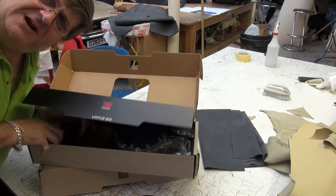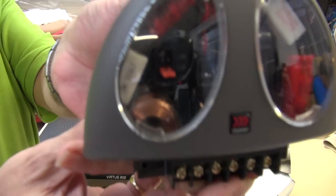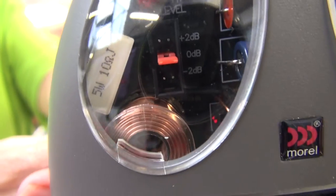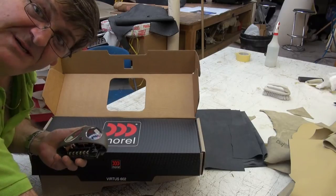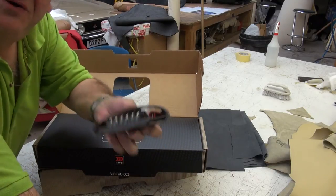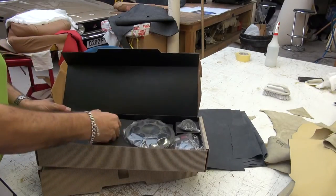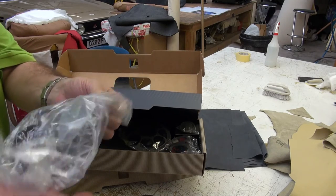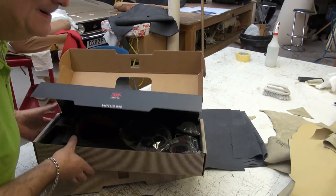Passive crossovers — the bits that are the traffic cop for the sound that sends the tweety bits to the tweeters and the rest to the others. Well, these are typically beautiful Morels. If you look deep into the actual box: zero dB, plus two dB, minus two dB. That's a little jumper that you move that engages or not those little square resistors, which is basically about attenuating or turning down the tweeter output. Now this is a passive device — we can't add anything, so there is no plus two dB; there are just two levels of attenuation. Very, very sexy. And of course one place to connect the amplifier wire, one for the woofer and one for the tweeter. There's a whole bunch of mounting hardware. For the tweeters, basically there's a whole load of different options. Look at these lovely little connections. And my favorite little bit — just like with JL Audio amplifiers, the Morel badges are the last thing that you stick on when you finish your installation, because they're so pretty and shiny.